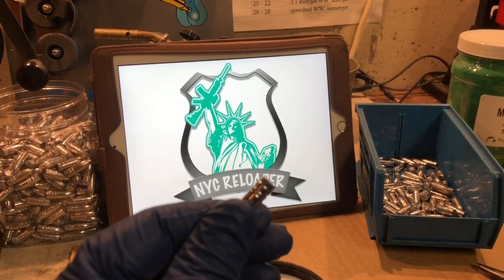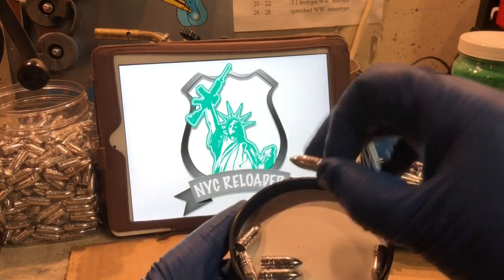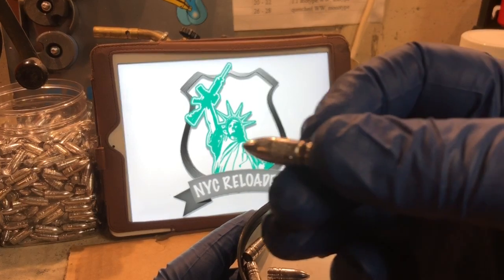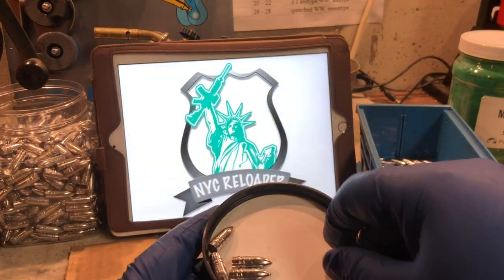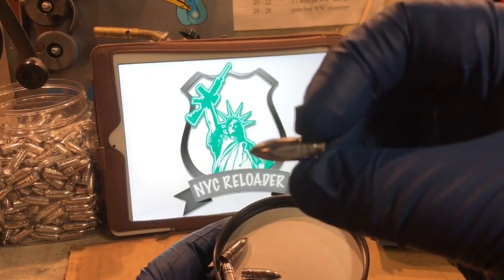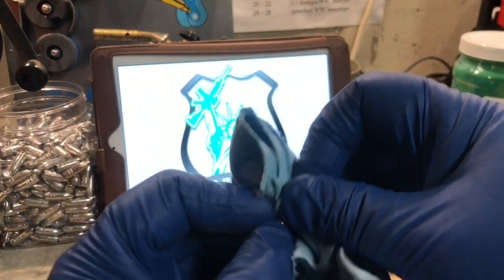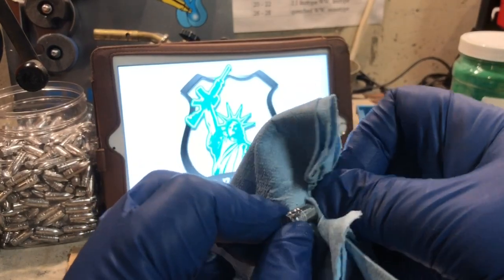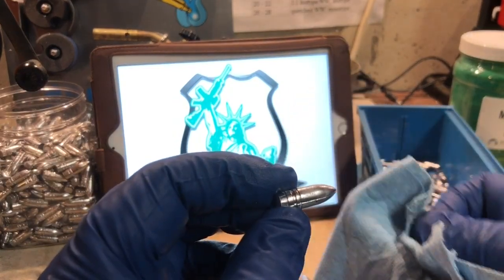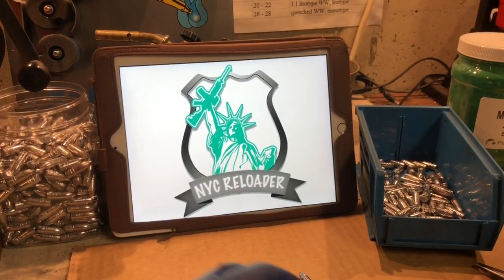I've gone ahead and quality controlled a bunch of these bullets and for the most part they were pretty good. Out of the rejects I have a pile here — I'll grab a couple and show you why I rejected them. This one isn't really smooth and I can do better than that, so it's going back in the casting bucket. I've got another bullet here with some water stains on it. It's not a big deal cosmetically but it will affect the powder coat. I can scrape it off or use a rag with metal cleaner, alcohol, heat, or mineral spirits — anything that evaporates quickly. Once it's nice and shiny with a good texture, you're good to go.